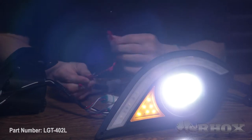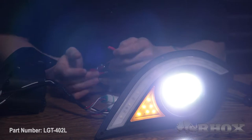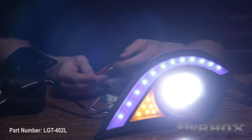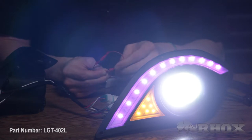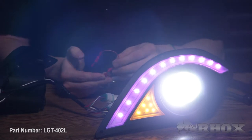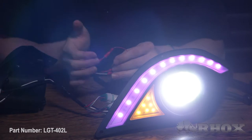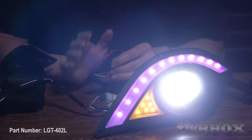This also has a built-in dual jumper, so I can connect two colors at one time. Say I wanted purple — I could connect it to the blue, and then connect it to the red as well, and that will give me purple. You can do that with the various different colors. This is how you would hardwire a color in. So if you knew you wanted blue, you could just hardwire blue in and not have to worry about anything else. I'm going to go ahead and turn the lights off.